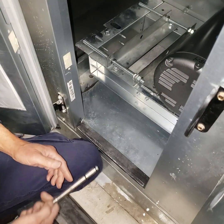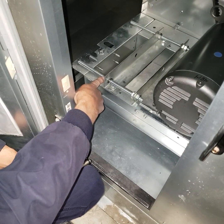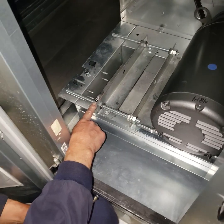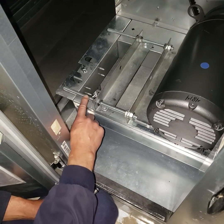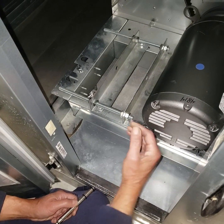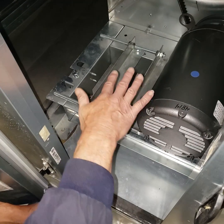To put on this belt, go ahead and loosen this stuff up — I have these here marked. If you loosen both of these nuts evenly, maybe go three or four turns on the flat. If you take these off evenly, you should be able to jack it back that way when you loosen up this other stuff. Actually you have to push it that way to loosen it, so you'll just be loosening this up. You don't have to worry about that because the marks will keep everything parallel and straight.